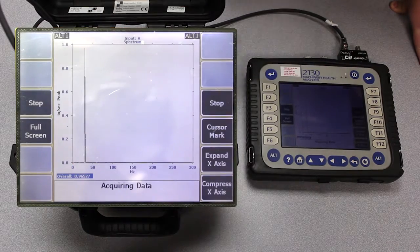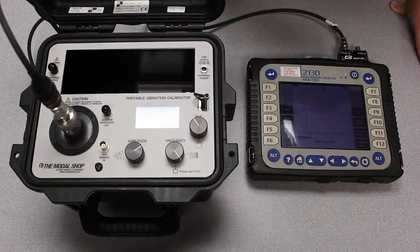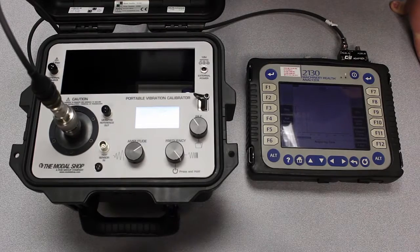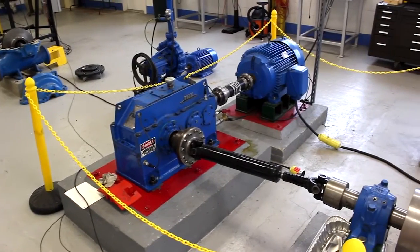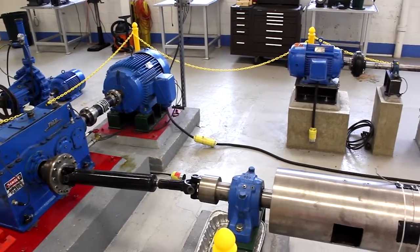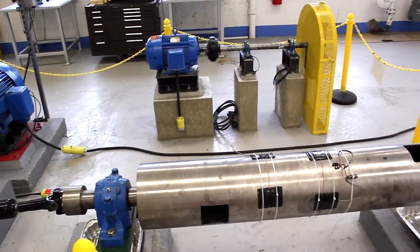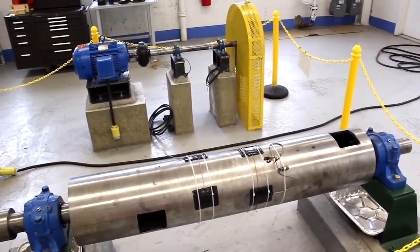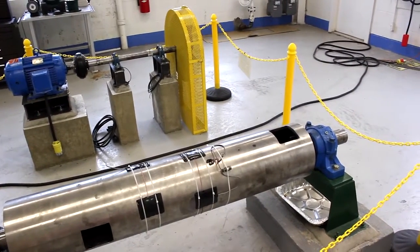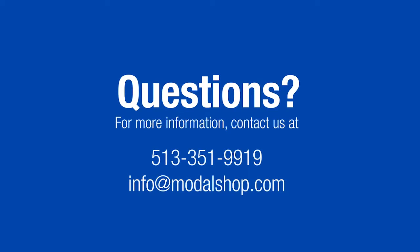So that is much closer. I was at 0.88 inches per second peak, and now that I've scaled the analyzer I'm within five percent of my input vibration, which is one inch per second peak. Special thanks to IVC Technologies located in Lebanon, Ohio, just north of Cincinnati, where technicians can not only obtain classroom vibration training but have the opportunity for hands-on learning in IVC's vibration lab, allowing them to pursue their ASNT certification. Visit IVCTechnologies.com for more information and ModalShop.com for more information on the portable vibration calibrator.